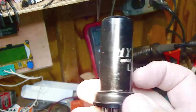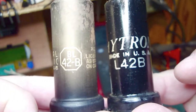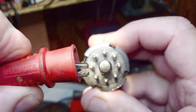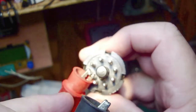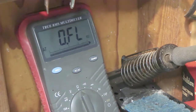Let me show you what it looks like with a replacement. Here is the tube I purchased as a replacement — I've already tested this in the radio so I know it works, but this is just for demonstration purposes. The original tube says BL42B and this one just says L42B; it's literally the same tube. With the replacement connected at the keyway, two pins over, you can now see I'm getting a resistance reading. On one connection I'm getting about 113 ohms, and on the other I'm getting almost 1.9K ohms.